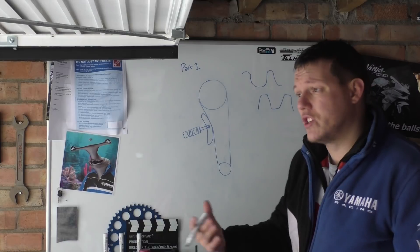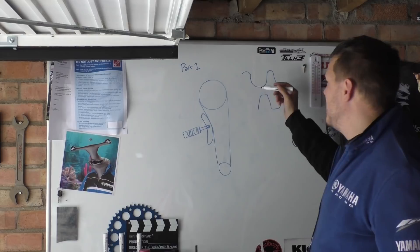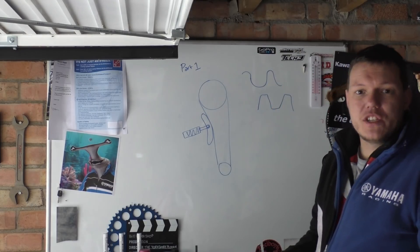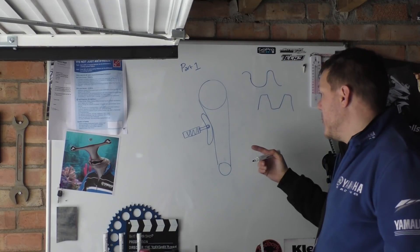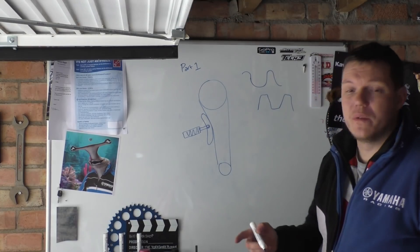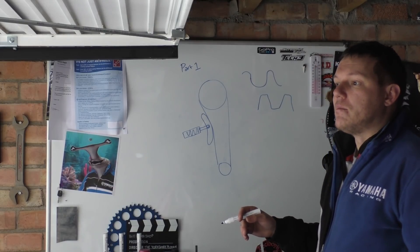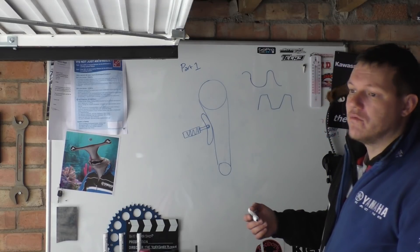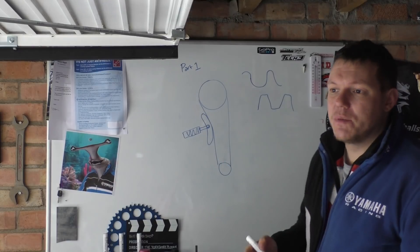The pros and cons for each really aren't that significant — it just depends on what they want to do. There is the argument of chain slip, but it depends on what kind of chain and what that chain is specced for. There's really no meaningful difference between using a sprocket or an involute gear profile. Usually it's a cost consideration — roller chains are generally cheaper.